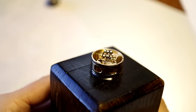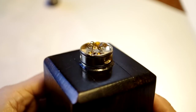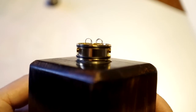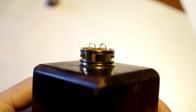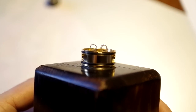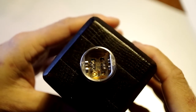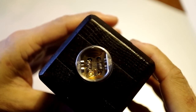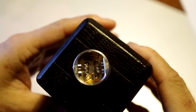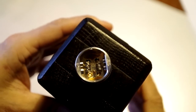And they have a lot of space below them, 1.5 millimeter at least. But the main thing to avoid the terrible turbulence and conflict between the coils, this is the space you should strive for, and actually even more if you can achieve it. I have saved out a millimeter for the tubes. Let me put the cap on. So as you can see, there is still more room. I can push my coils further to the side, but I will not risk losing cooling in the dead center of the coil. So I'm happy where these are now because these are going to run extremely hot.